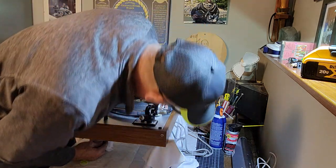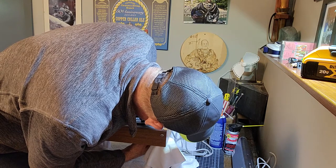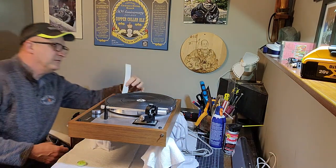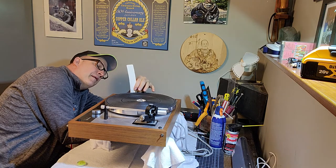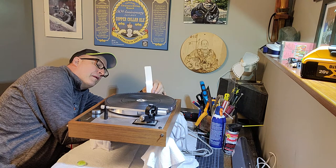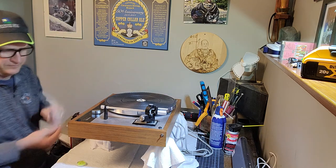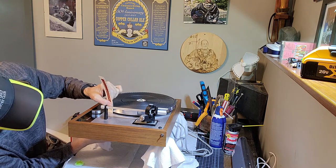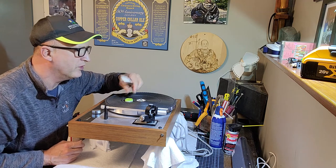I'm going to have to get my face into here. That's a little high on this side, so we're going to adjust this spring. Just 6. And this side is going to have to come up for sure. Six. And of course, if I raise that in, this side will dip, so you have to do it back and forth until you get it the way you like it. And then you can put the spirit level on. Oh, and it's very close.